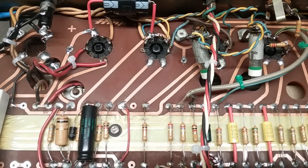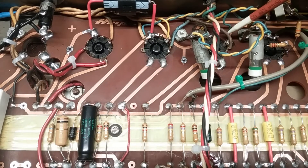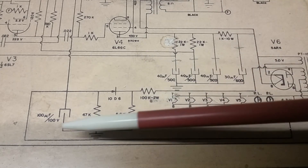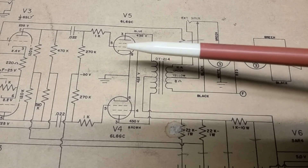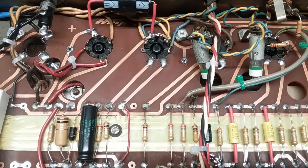I've carefully gone through the schematic of this amplifier and confirmed that all voltages are sitting well within acceptable tolerances — especially considering the difference in line voltages of today versus when this amp was manufactured. So let's get down to checking the biasing. This amplifier is fixed biased at negative 50 volts DC to the grids of the two 6L6GC output tubes. I confirmed all specified voltages sitting just about where they should be throughout the bias circuit.